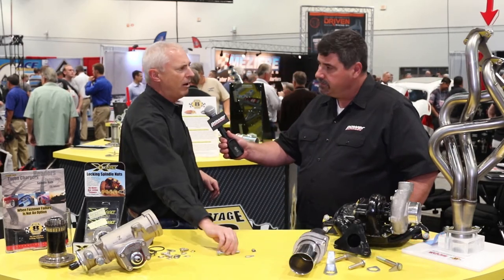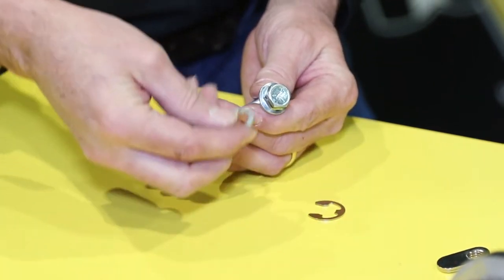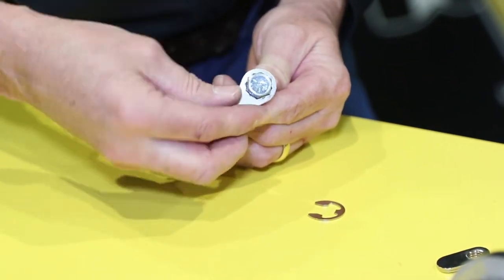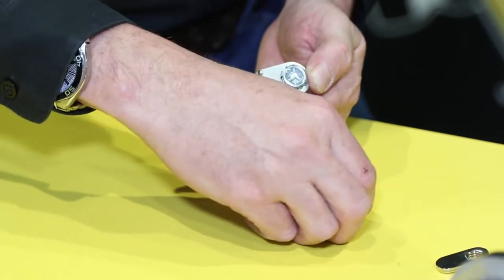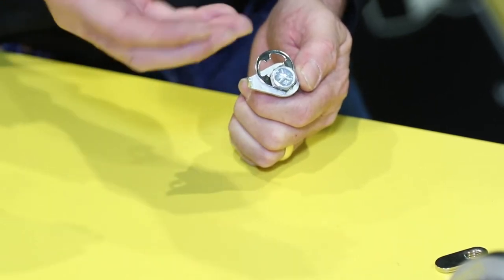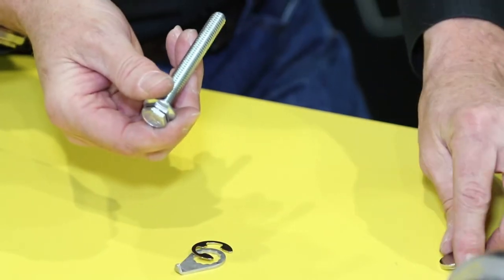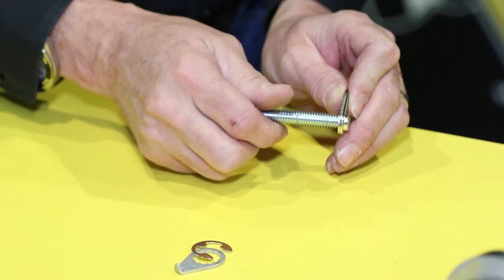Like our header bolts, we put a groove in the top of the bolt, the bolt gets torqued down, you put a locking retainer on the top which goes against the tube, and of course a clip to keep that from falling off. But we added one extra piece of hardware — this is called a threaded tab. The threaded tab goes on the back, it'll flip around and hit the tube on the back, so you only have to wrench one side.